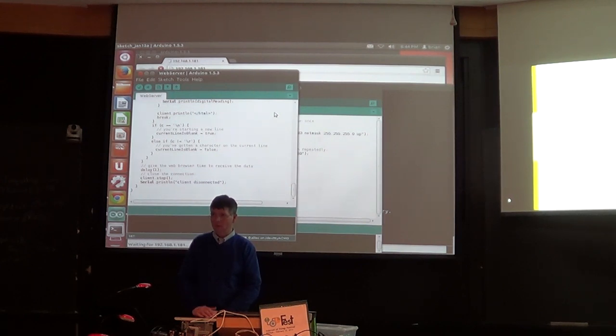So you could have just your kernel and most frequently used stuff, which is mostly read-only, on a flash partition, and have your videos and other stuff on a big rotating drive. On your SD card, you could have a little bit of code that would boot over the network, and then just pull everything over the network.